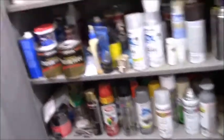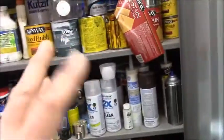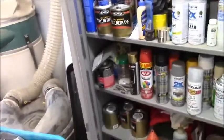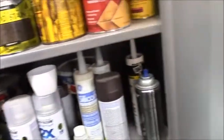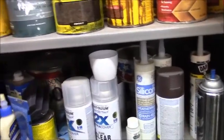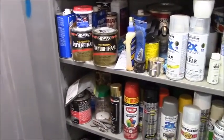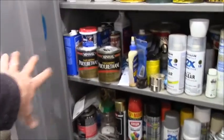Now here's something important about polyurethane: if you buy the gallon jug, it's going to have a marking on it — something like WA or WB — 350. That is the new politically correct version and it's a very, very dark color — darker than maple syrup — and it tints your wood. But if you buy the quart sizes of the Minwax clear satin, it's the old stuff that isn't politically correct yet, and it's just a very light honey color. It gives your wood a beautiful glow. I hate the new stuff — the old stuff is still the bomb.